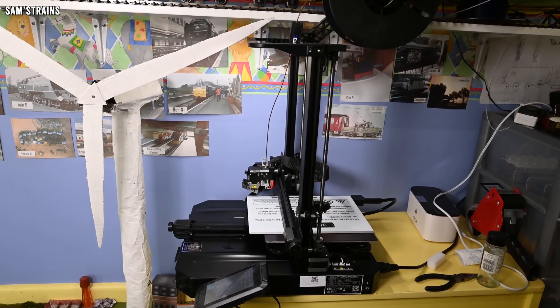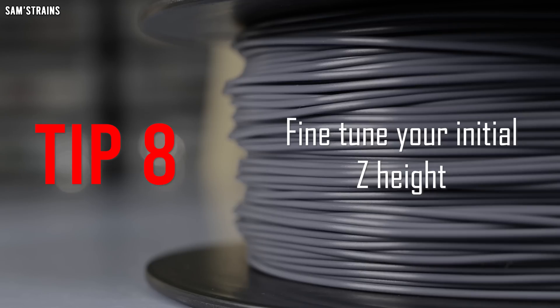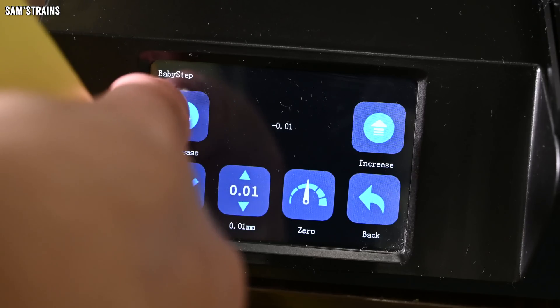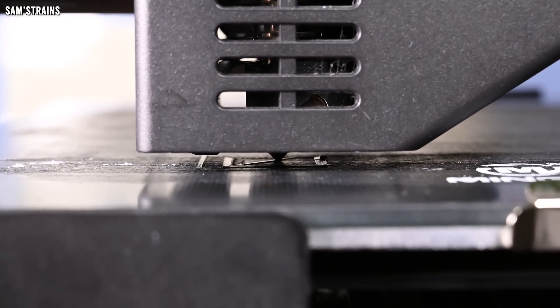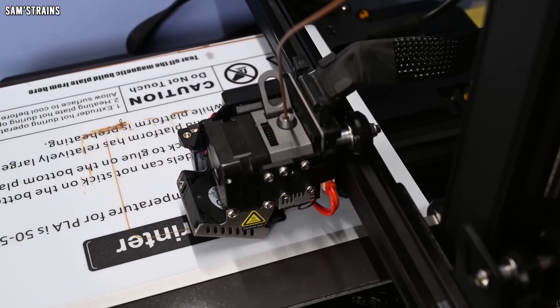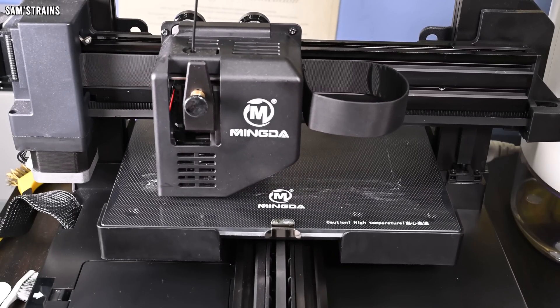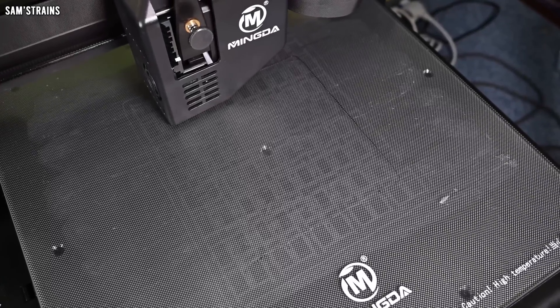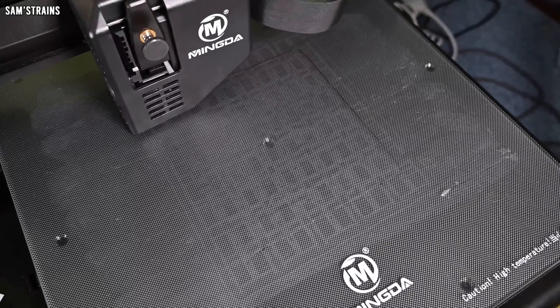Let's move on and talk about some tips for your 3D printers themselves. The first tip is to tune your initial Z height — the starting height of your extruder on the first layer — and most 3D printers give you quite some control over this. If you print too close to the bed you'll never get parts off without destroying them, and if you print too far away things won't stick. The best machines for tuning your Z height are the Mingda ones, as you can literally adjust these on the fly — if you print with a skirt you can adjust the Z height while the skirt is printing and by the time the machine gets to your part hopefully it will be set perfectly.